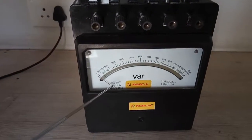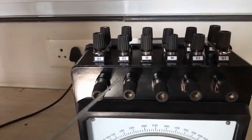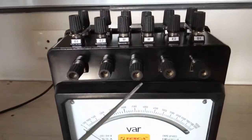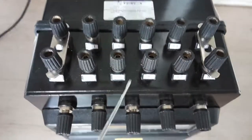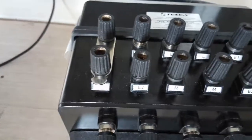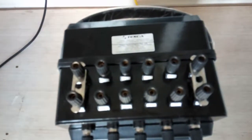With the help of this screw we can set that position. These two are the voltage terminals — this one, this one, and the middle terminal is common. The current terminal is this one, marked as LM. These four terminals are current terminals. The terminals marked E1 and E2 are the changeover terminals.